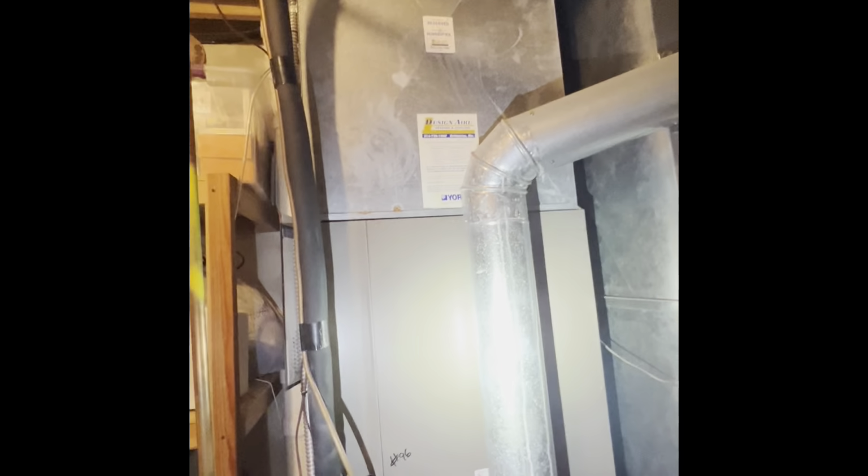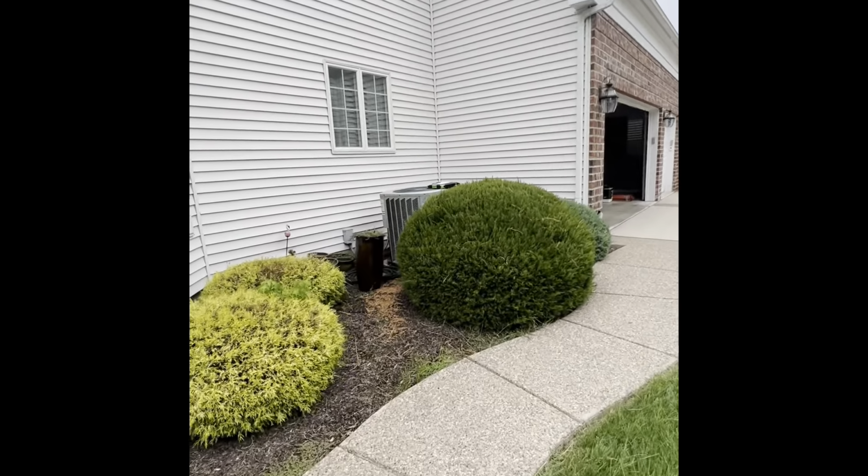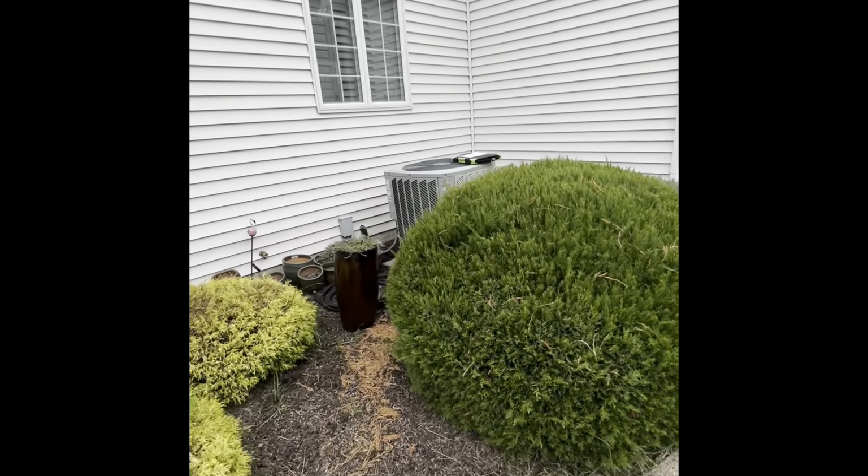We went high efficiency on the furnace side. Keeping in mind, we've got all finished space around. Probably our best location will be going out the front here. Taking out one of these joists, we'll look outside and see exactly where that puts us to make sure that's achievable. Any questions?